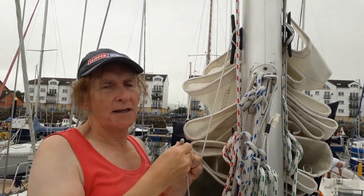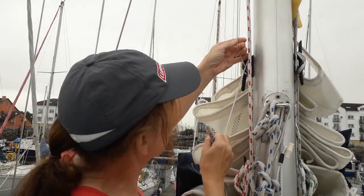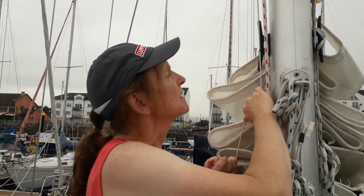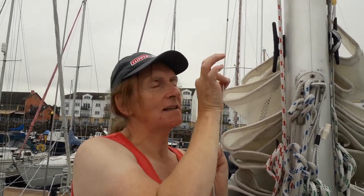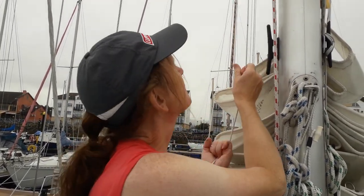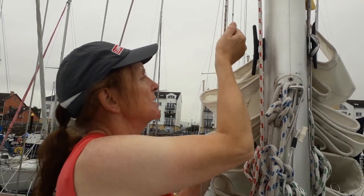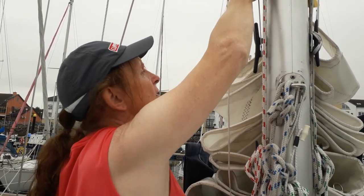What are you doing, Bev? I'm marking the Dyneema because I'm going to splice it. The idea is to make a loop which can be pulled down and put over that. I've got to be careful not to overdo it though, because it's actually got to get over this. When we selected this Dyneema, what did we not bargain on? Having big fat hands on a little thin line. Because it is as slippery as anything — you can't really get a grip on it unless you wrap it around something, which is a no-no on a sailboat. So I'm going to put the bite of my splice about here so we can just bring it down to this point and loop it on.